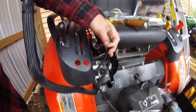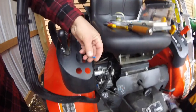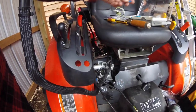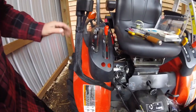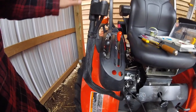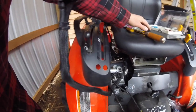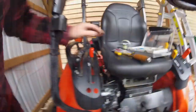So we're going to bring our wires through. We're going to throw our spade connectors on the end of our wires and then shrink wrap them a bit and then connect them up to the switches. And then before I start mounting the lights, I'm going to do a quick test to make sure the voltage is flowing through before I snap these switches into place, because once I stick them in there I'm going to have a hard time getting them out. All right, see you in a minute.